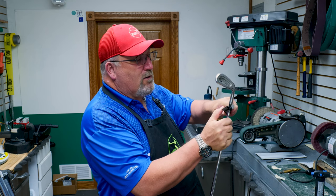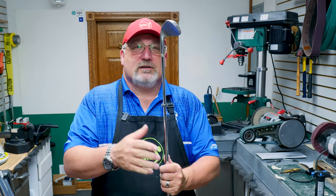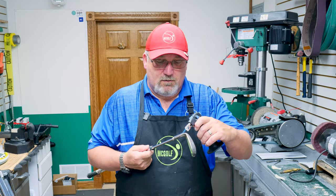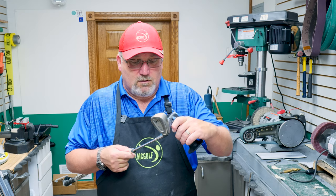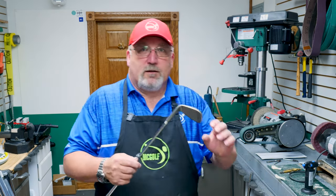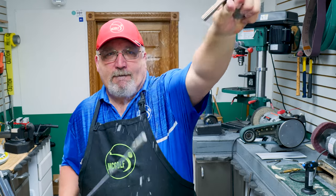The reason I'm telling you this is I tried doing it without moving the ferrule first, and the ferrule actually binds to the head in this particular instance, making it very, very difficult. You can still do it, but get it out of the way and make it easy. This thing has been together for 20 to 30-plus years, so it's attached pretty good. We're going to have to give it some heat and go around.